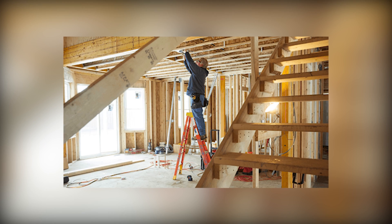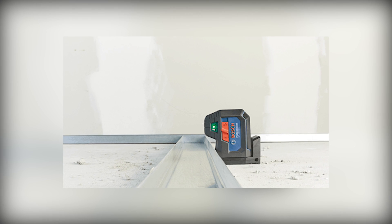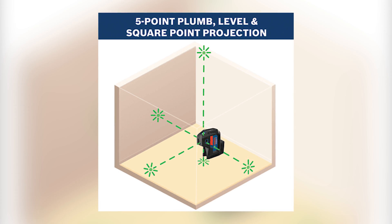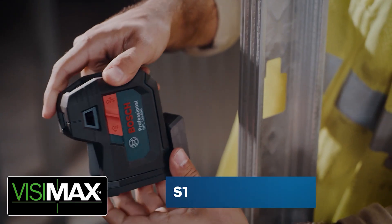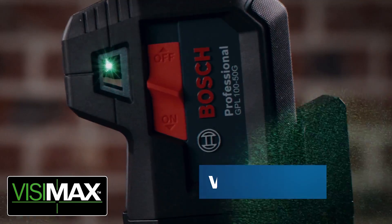For this size, what type of applications would this primarily be used for? So with the dot or point lasers, a lot of times these are being used for layout, for squaring up layout walls if you're going to add a partition, and then doing point-to-point transfer. So if you want the same plumb point from top to bottom, if you're doing through penetrations on walls from one wall to the other and you want those to line up level, you can use these for that.